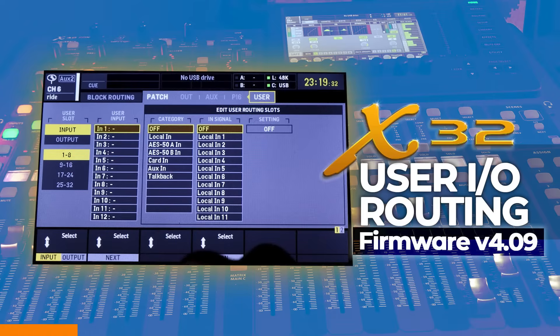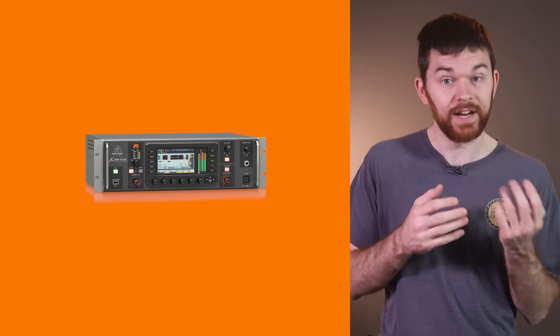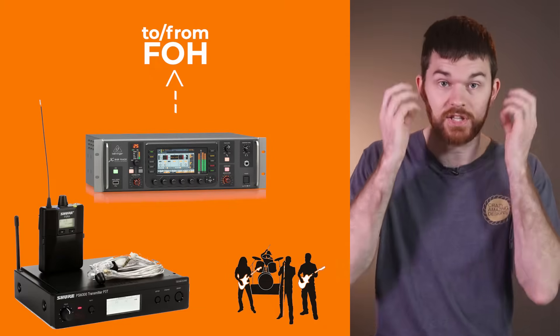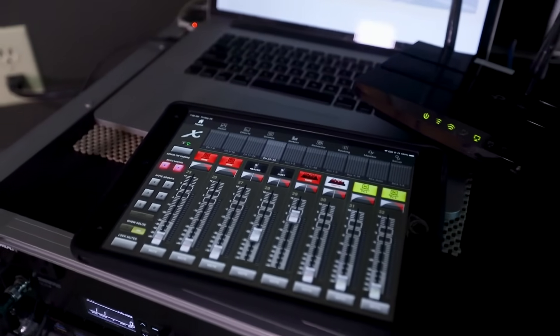This is the third video in my X32 routing series. Previously, we learned how to route audio from an X32 console to connect local inputs and local outputs. Then we connected our first digital stage box via AES50, the X32 digital audio network. Now we're going to go one step further and add an X32 Rack that we're going to use both as a digital stage box to send and receive channels, but also as a standalone mixer so the band can mix their in-ear monitors. Having a dedicated X32 for in-ear monitors is great because it means the band isn't connected to the front of house console through the app used to adjust the in-ear mixes.